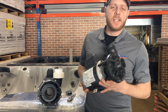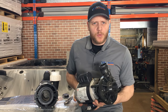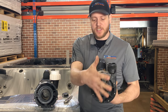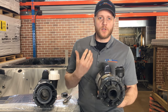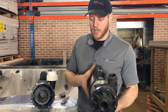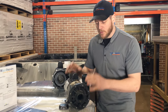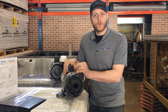If you're getting a dry or flow error or no heat but all your jets are working, that typically means you have a circulating pump. This is a separate system on its own — it does not return to all of your jets, so you'll think the hot tub is working fine but wonder why you're not getting any heat. Probably because you have a circulating pump, and it's the same process: locate those bleed nipples, take off your unions, bleed the air out, and away you go.